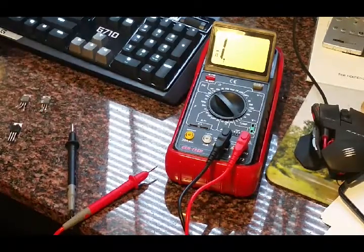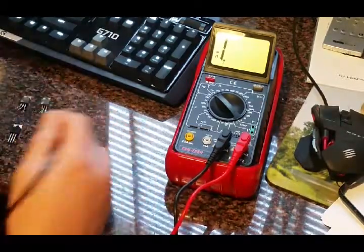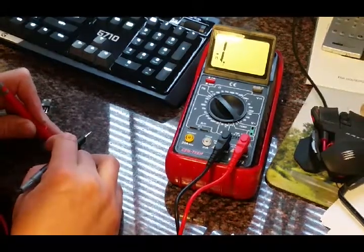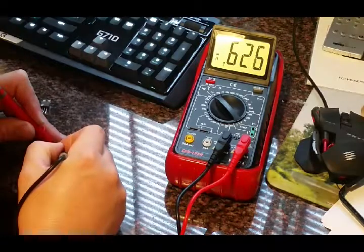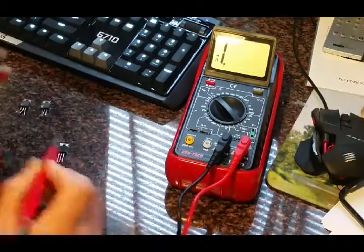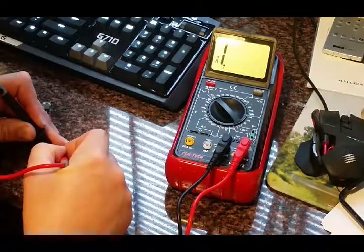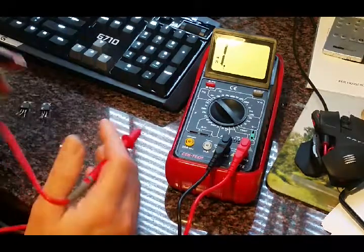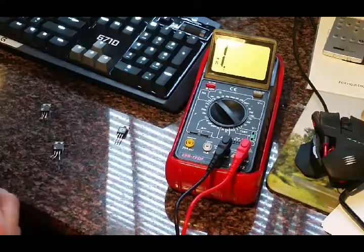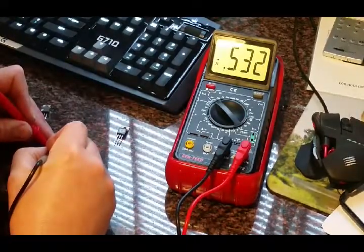So we have our transistors out of the receiver. I suspected it was probably one of the failed transistors. First we're going to test a known good transistor. If we're on the base here and we test on the collector and the emitter, we're going to get current flow. Now if we turn this around and test again, you get nothing — because that diode is supposed to block anything that would flow backwards. So this is a good transistor. Here's our problem — our bad one. We're good on that center leg, but this right leg doesn't do anything.